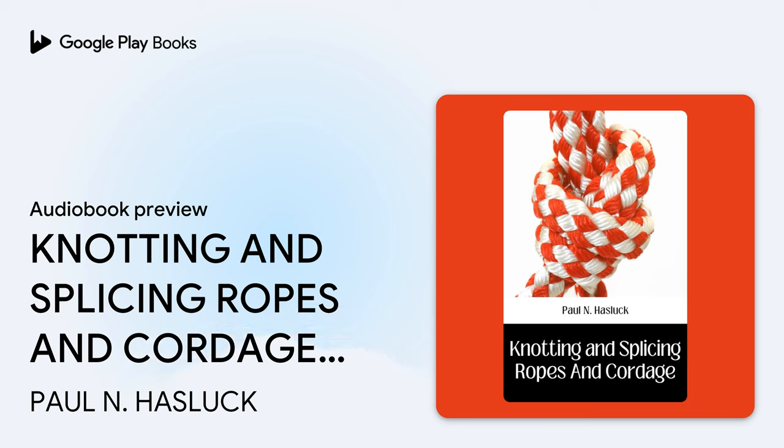A three-stranded rope will bear a greater strain in comparison with its size than any other of the same material. Cable-laid ropes and four-stranded ropes are, roughly speaking, about one-fifth weaker. Rope is measured by its circumference, and is laid up in lengths of 113 fathoms, sizes varying up to 28 inches, but it is not usually made up in coils when the size exceeds 5 inches. Very small ropes are distinguished by their yarns rather than their size; thus sailors speak of 9, 12, and 18 yarn stuff, which is commonly called seizing stuff.